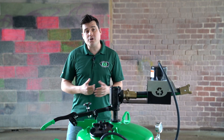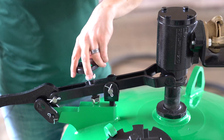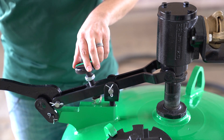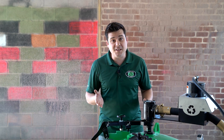When the machine is pressurized, the air pressure will want to lift this pipe as high as it'll go, which would use entirely too much abrasive. That's what this knob is for — it simply limits the height of the outlet pipe. We need to start in the locked position and increase flow in quarter-turn increments from there until we find the sweet spot.